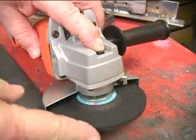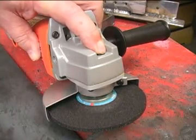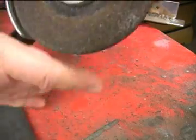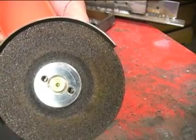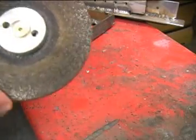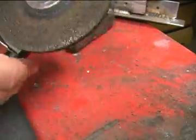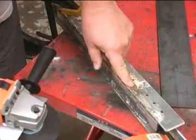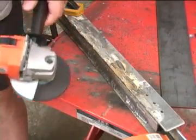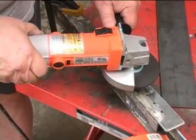The push-button spindle lock on top of the gear case does work pretty well, but it reveals another problem. With the spindle lock fully depressed, you can see how much play there is in this gear set. I worked with race cars for 30 years and can promise you that that much play in the gear set doesn't bode well for the gears themselves or anything around them. All that play between what are probably cheaply made gears adds up to a bunch of noise and some vibration, as you can hear now with the sound back up to its original levels.